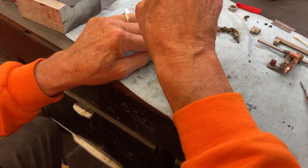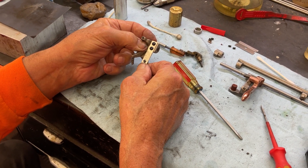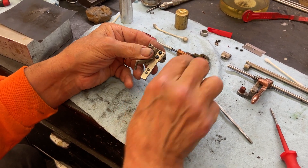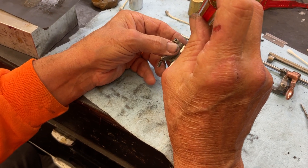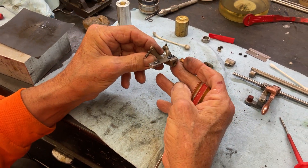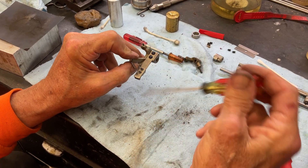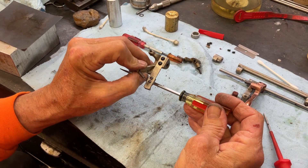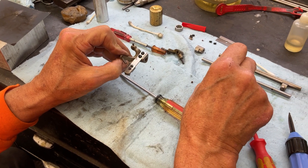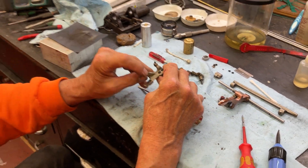On Triumphs and A1s and similar machines, you can see this moving back and forth — this is an adjustment. The half nut will also move back and forth, so we'll leave this just slightly snug, not tight. When everything is in the carriage, this is going to come down spring-loaded and held in place, and then the lead screw will come in and hit like that.